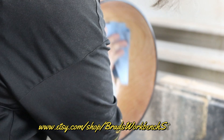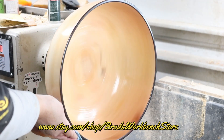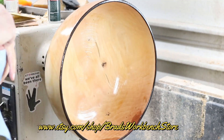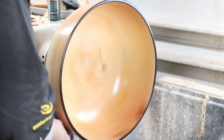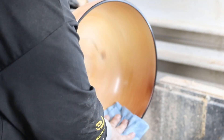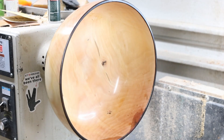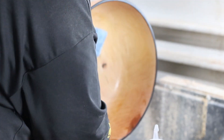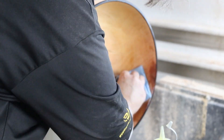I had to go back and sand from 400 grit to remove those sanding sealer lines. After I was done with Brad's sanding paste, I wiped that off with denatured alcohol to remove any residual before applying the Tried and True Original. I applied one coat, let that set for an hour, then burnished it with steel wool. I applied a second coat — that stayed on about six hours and soaked completely into the wood. I burnished that and applied a third coat, which turned out fairly good, so I didn't need any more coats.